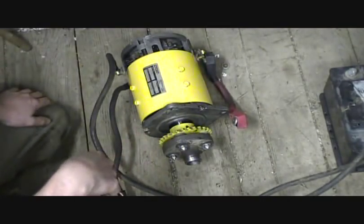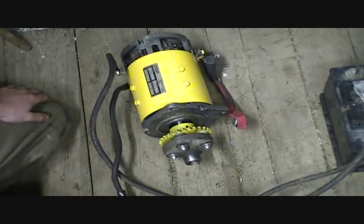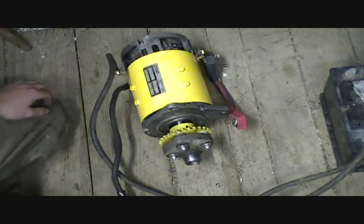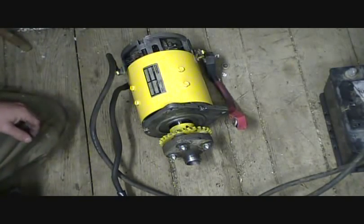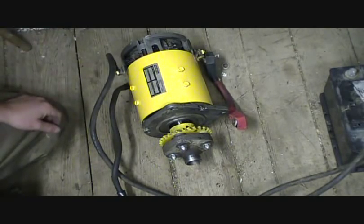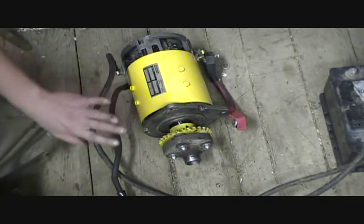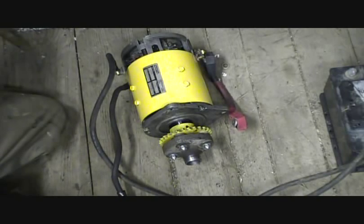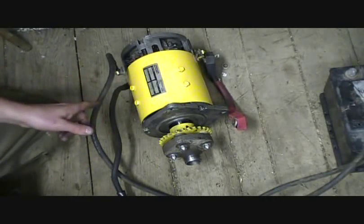At six volts it spins that fast, and the load is much less — there's much less out of balance to it. It sounds really nice — it's got an interesting whine but I think it'll probably go away as the brushes wear in a little to the new, less crappy profile of the old commutator. Rebuilt, painted, looks nice. Got a fabricated plate for this to mount up to my bell housing so I can hook it up to my transmission, and good to go. Thanks for viewing — subscribe if you're interested. To see how slowly it moved before I rebuilt it, check out part two of this series.